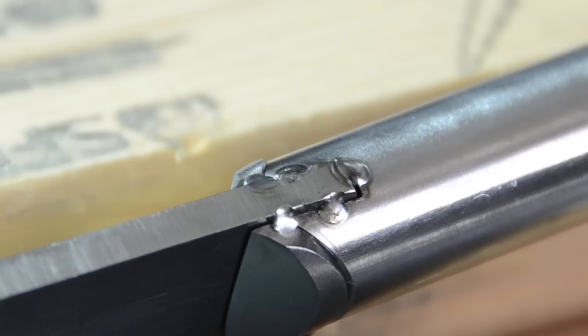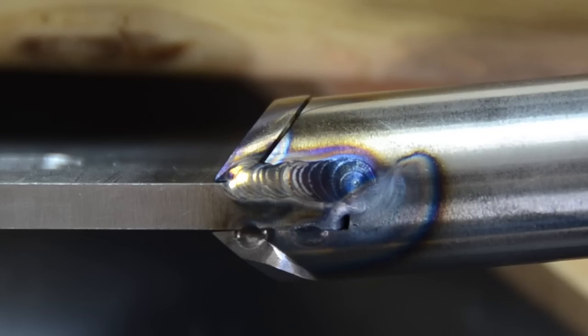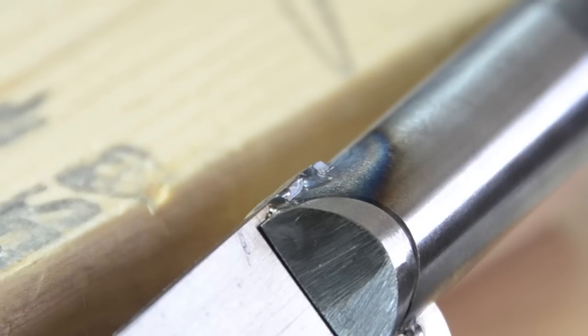All right, the first weld is going on the bottom right here. Got kind of a slow start. And it's hard to tell how much heat to put in the first time you weld one of these things, because you're dealing with the tube is 1 millimeter wall, and the cap is I forget, but it's a little thinner than the thickness of a dropout. So I stacked those too closely, was moving too slow, and the end got a little too hot.